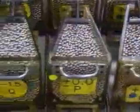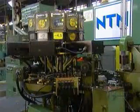Then they get a bath in cleaning solvent. After several quality checks, the finished balls go into hoppers. The hoppers load onto the automatic assembly machine. The ball feeder sends balls down through tubes to a ball pusher that feeds the correct quantity of balls into the raceways of the now reassembled inner and outer rings. A ball divider positions the balls evenly around the raceways.